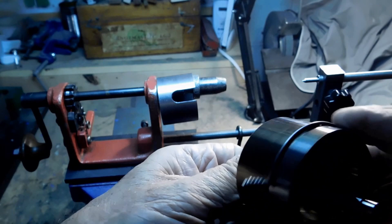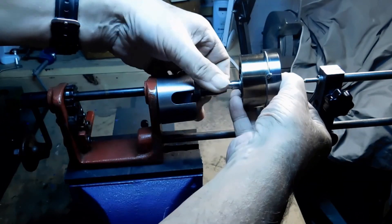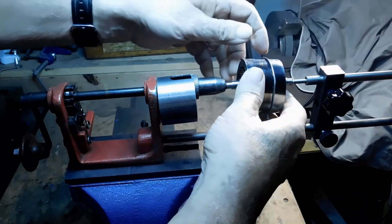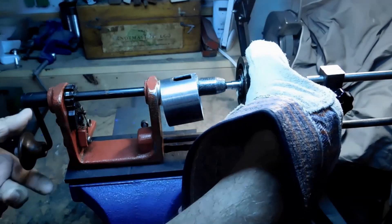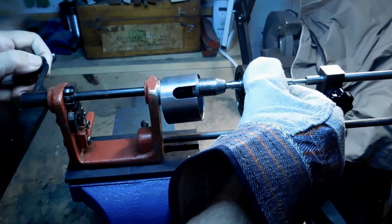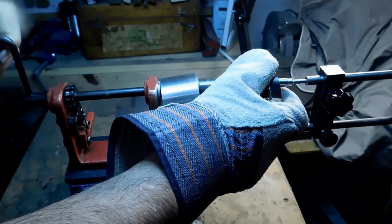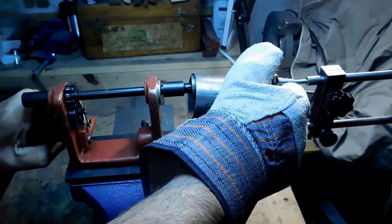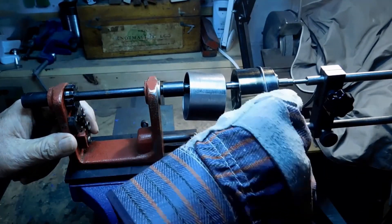Here's the mainspring winder — there's the chuck and the tailstock. We want to hold this thing very tight; it's a pretty good sized spring. Now I have the sleeve on there — I'm not going to need the sleeve for this operation, but what I'm doing now is just checking to see how much smaller I have to make this mainspring to get it to fit inside that barrel. I've got to come down quite a ways. Let me get that bailing wire off first — I want to make sure I've got the ratchet set up right.